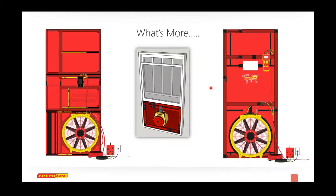The first is the poorly weather-stripped doorway, which would have approximately a sixteenth-inch gap, equating to about 14 square inches total of leakage when that real door is shut. The second is a well-weather-stripped and adjusted door, around three square inches of leakage when shut. And there is a super tight door that might be as tight as one square inch but possibly more. As a rule of thumb, if door panel leakage is about 10% of the total leakage you're testing, you need further investigation.